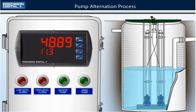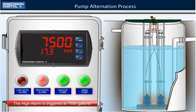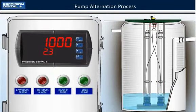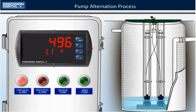If the storm gets more severe and both pumps cannot keep up with the rising water level, relay number two — the high level alarm — will trigger at 7500 gallons. The water level may need to be corrected manually to prevent overflow. Notice relay number two resets automatically at 6900 gallons. After the issue is corrected manually and with both pumps active, the water begins to drain. Both pumps shut off when the level reaches 1000 gallons. If the level keeps dropping and reaches 495 gallons, relay number one — the low level alarm — will trigger. The alarm will reset when the issue is corrected and the level rises above 750 gallons.